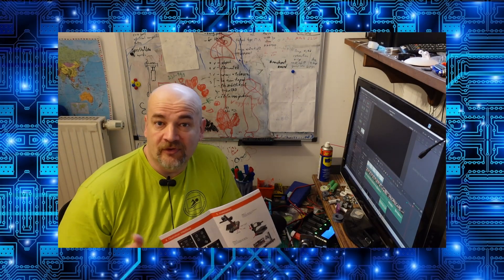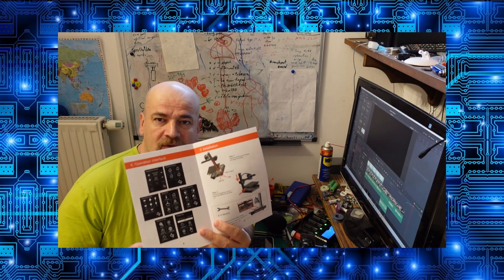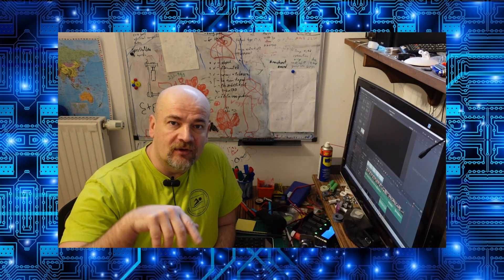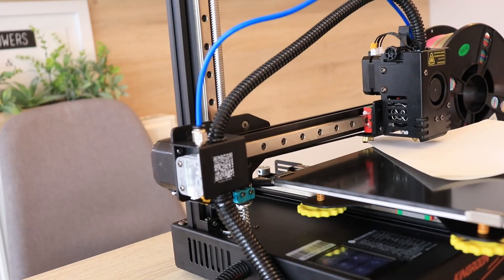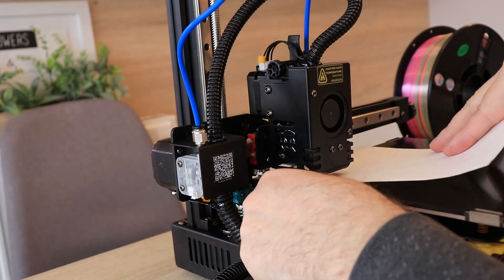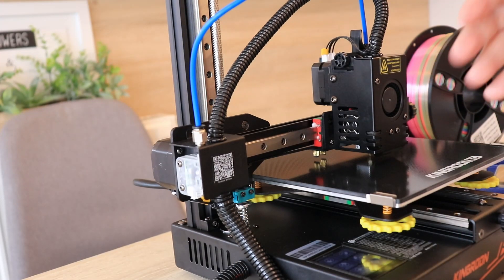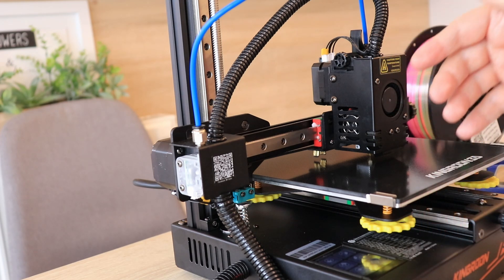It's Igor from the future who is always smarter. It's partly my mistake, partly a weak user manual with only two small pictures. Actually there are two additional smaller bolts which have to be screwed in from the bottom first, and only then the rest of the screws. Now I can finish the leveling process — and it's perfect. A smaller bed size is always easier for manual bed leveling. Now let's put some filament in and do some printing.